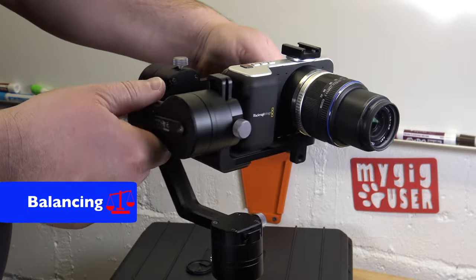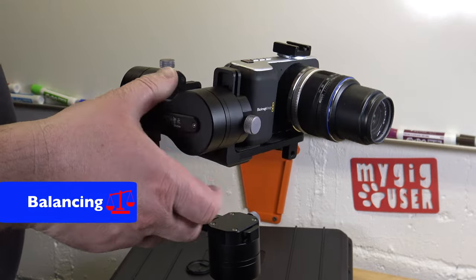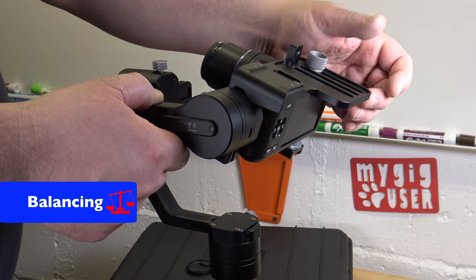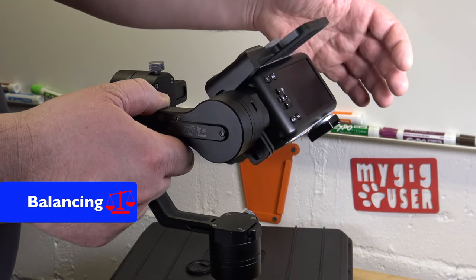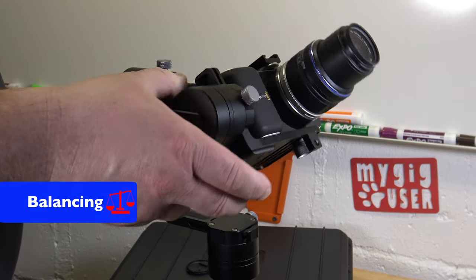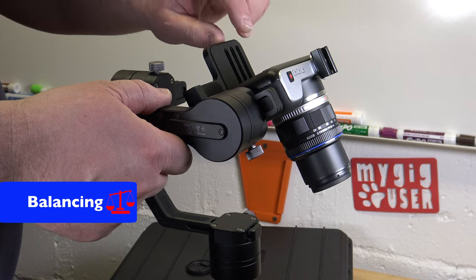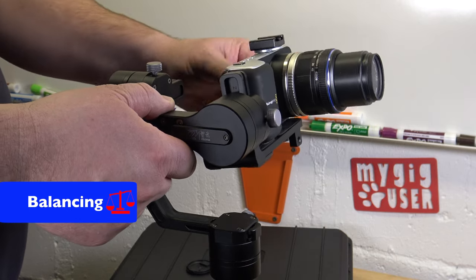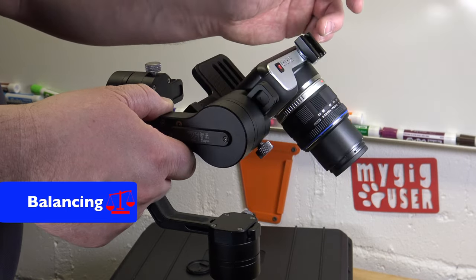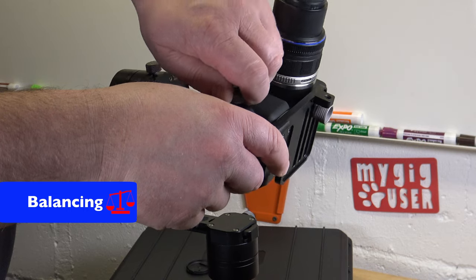This is probably all the way up there, because the bracket is pretty heavy — probably the same weight as the camera. So now it stays up there; it doesn't roll down, or it's very hard to roll down, so that gets closer already. The goal is that when you manually move the camera around in any position, it stays there and doesn't swing to any other position. So this is not 100% but it's pretty close. For the motor, that means it doesn't need much power to put it into any position, and that's the point of it.